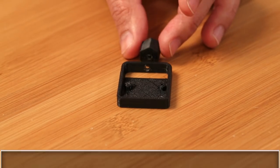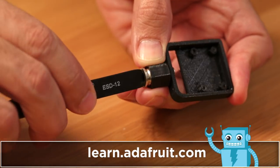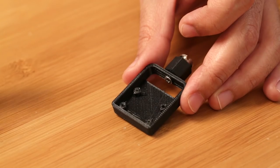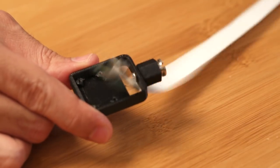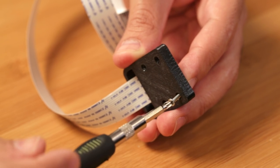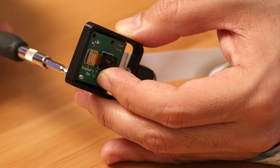To start this project, we can attach the base connector to the enclosure using an M3 screw, and then install the camera tripod adapter to the inside of the base connector. We can then insert the flex cable from the Pi camera through the opening of the enclosure part and just pull it all the way through. You'll want to lay the camera board over the standoffs and hold it in place while fastening four machine screws into the back of the case.